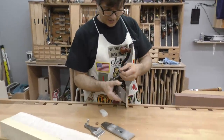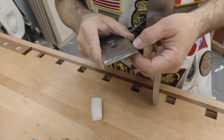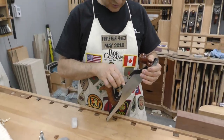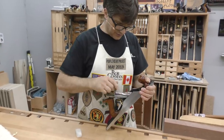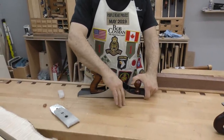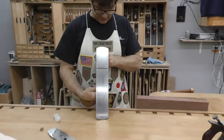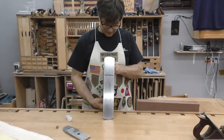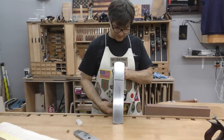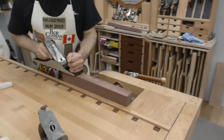We can do it with a blade. What I've done is instead of a little tiny back bevel that I normally do with my sharpening procedure, I've put on purpose about a millimeter and a bit wide, 20-degree back bevel, and polished it up just like you would the back of a chisel. What that does — if you do the math, the blade is held at 45 degrees, but because there's that 20-degree pitch on the front, you're adding 20 degrees to it, so now you're planing at 65 degrees. It makes it a lot harder to push, but it also does a lot to control tear out. It also makes the edge fairly strong because it puts that much more metal directly behind the edge.